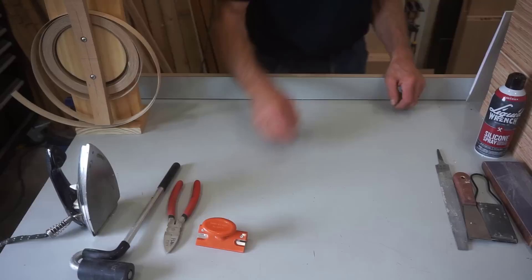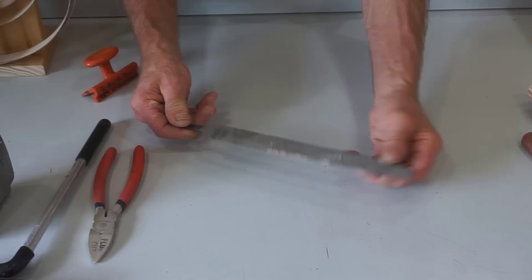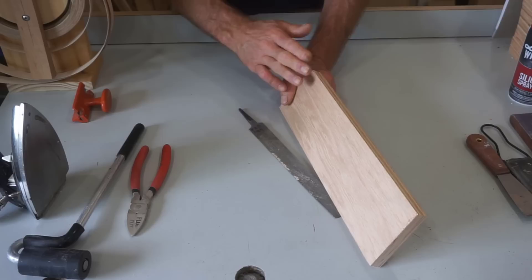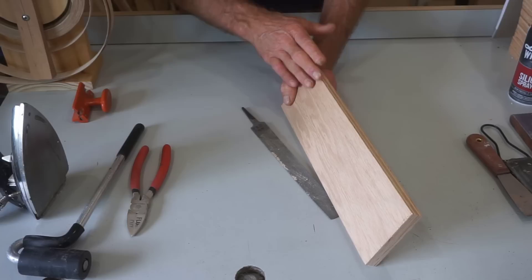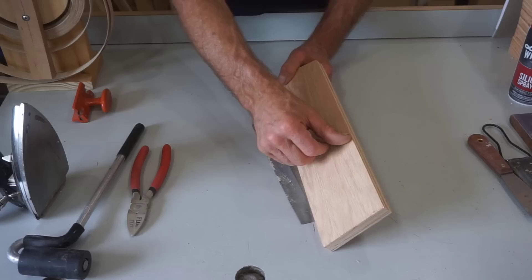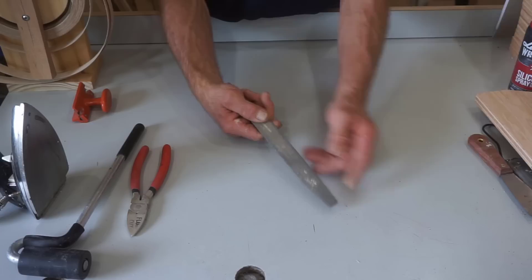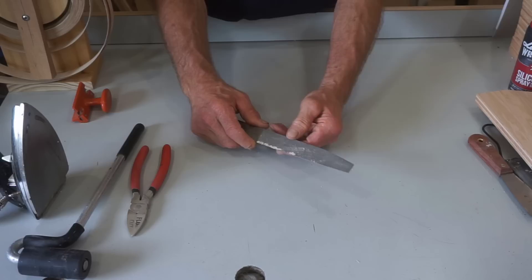The next tool I use is probably unique to me — this is a laminate file. I've had this one for 20 years, and I use that instead of sandpaper. After the edges are trimmed with a blade, a lot of people use a piece of sandpaper, but I don't like that because if there's an irregularity in the edge of the edge banding, the sandpaper just follows that irregularity. You've got to do more work, and you can over-sand some areas and still not adequately sand all areas. So I use a file. I'll demonstrate that in a little bit. I like it because it actually cuts off any excess edge banding, trims it, and I can also set an angle — which you'll see later.